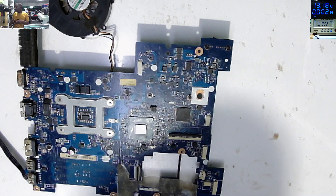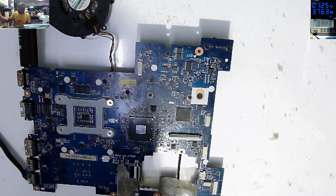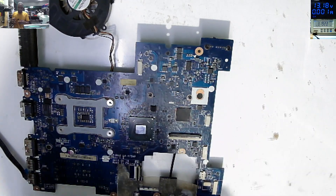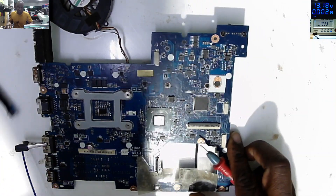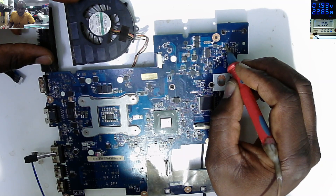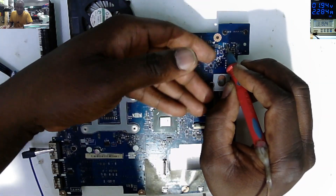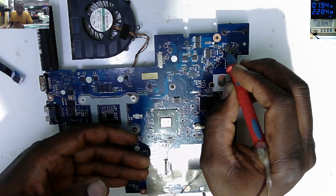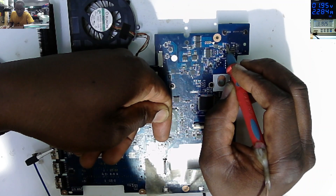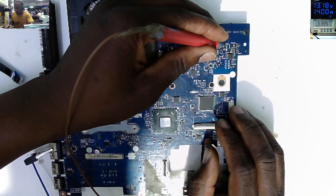Let's come with the power supply - 4 amps, that's too much. Let's lower the current to 2.2 amps, even with 13 volts. I'm just wanting to see what is getting hot here, what is shorted on this motherboard. The voltage dropped to 1 volt and it's taking 2.2 amps. I think it's a good moment to buy a thermal camera to make my job easier - I can't see anything getting hot.